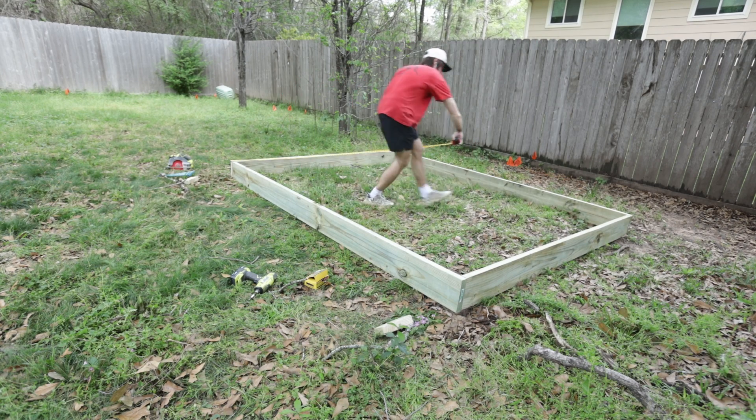That fits really nicely. Now this is sitting on the front part of the joist, which is going to be where all the joists hang. We're going to have joists going this way and we're going to put the hangers on there, which I will show you pretty soon. But before we do that, we're going to temporarily seal this down with a couple screws, and then we'll come back and put real hardware in, including a structure bolt from this side of the joist.